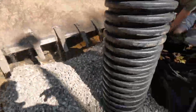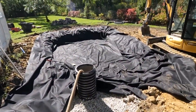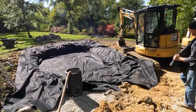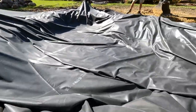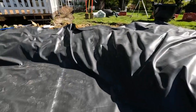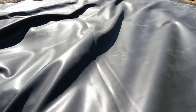Rock pad is going in — we put a couple pieces on the very bottom for protection. We still have a little three-quarter trap rock to make it nice and soft. Now we're getting our liner in — we've got a 25 by 35 EPDM liner and the liner snake. We'll get it unfolded, laid out, and all the folds out, then start rocking. We've also put down some lightweight geotextile underlayment for a little more cushion inside the liner.